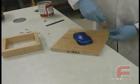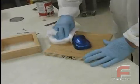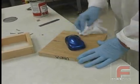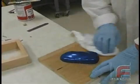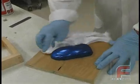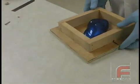Note that the wood has already been sealed with the wood and plaster sealer, so the surface itself is not porous. Otherwise, the silicone rubber will reproduce the surface of the wood, which is not what we want. For more information, refer to our other video on sealing wood. Finally, we screw on the sides of the mold.